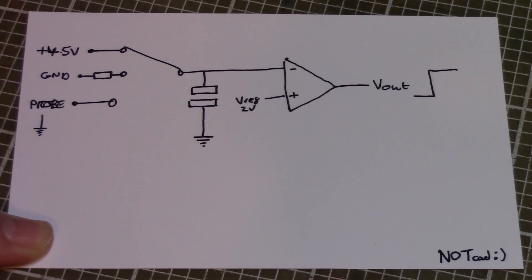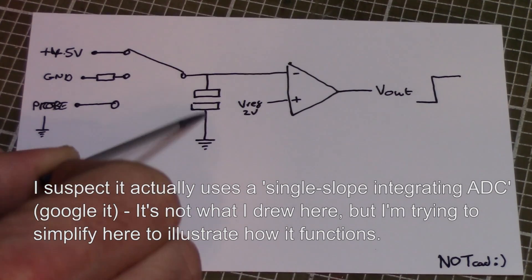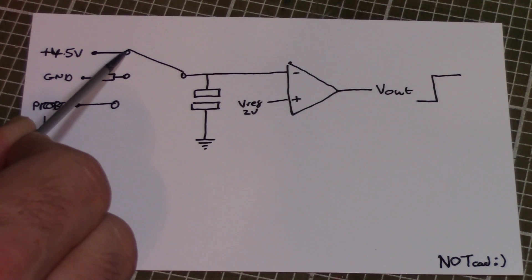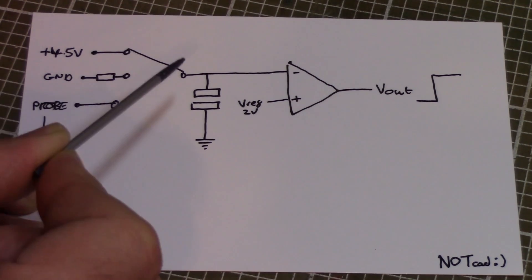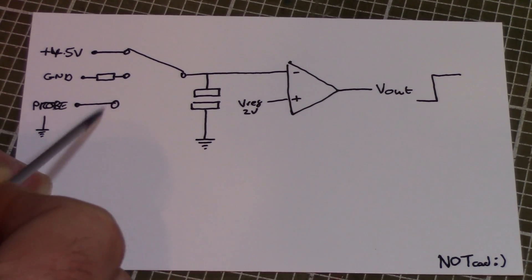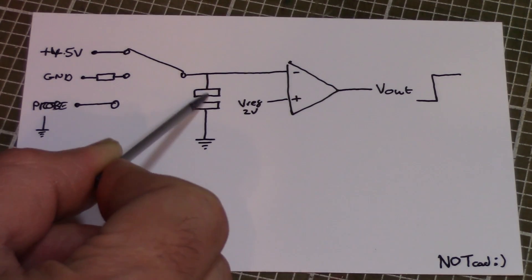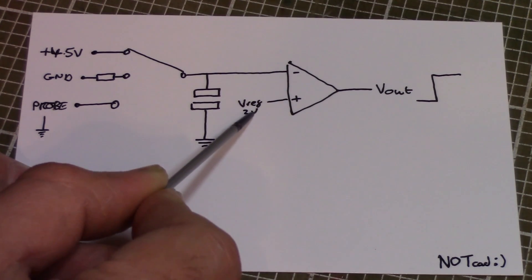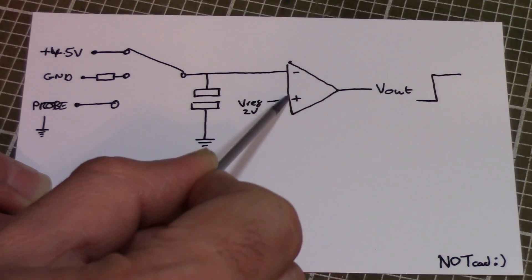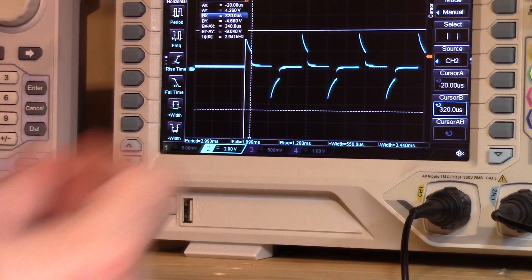Here's my thought on how this circuit inside this probe might actually be working. As a for example, they could have a capacitor — just a reservoir for storing electricity — and an electronically controlled switch. First they connect it up to 4.5 volts, and we see that peak up on the oscilloscope. Then they switch over and connect it to the probe instead, and the electricity inside this capacitor starts to discharge through our nutrient solution. That voltage on the capacitor then drops, and if they compare it to a voltage reference chip — some kind of 2 volt reference — at the point when the capacitor has discharged down to 2 volts, the output signal will rise up high and they know they can stop the timer.